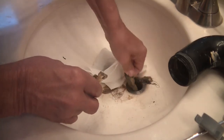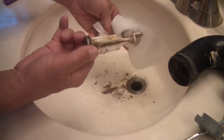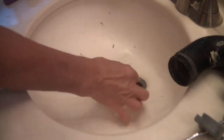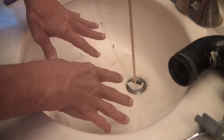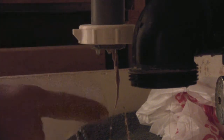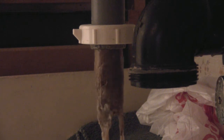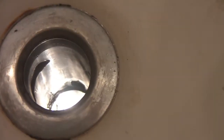It's just clogged and sitting there decomposing — just wipe this off a little bit and get all that stuff off of there. That's all decomposing and this is where you're getting your stink from. Now I'm going to wad up a paper towel and shove it in there, then wad another one up and shove it in. This is where that piece of dowel rod comes in — to shove it through, getting everything along the sides to clean it all out as you push through. Watch as I push that rod through and it pushes the paper towels through — all the stuff's going to come out. Look at all that coming out. Now as you see, that's nice and clean and there will be no more smell.